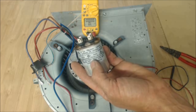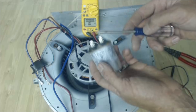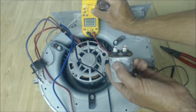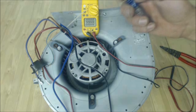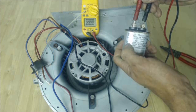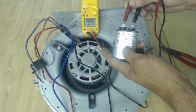Now we're going to check for capacitance. We're going to scrape the terminals to get any stale remaining voltage out of the capacitor. It won't store as much as when it's running, because when the blower motor turns off it discharges the capacitor for the most part. But just for an accurate microfarad reading, we want to make sure it's completely discharged. Use a screwdriver — the actual metal, not one with paint on it — or a 10,000-ohm resistor. I just usually scrape them, and that works for 5-ton systems and smaller, typically 80 MFD and less.